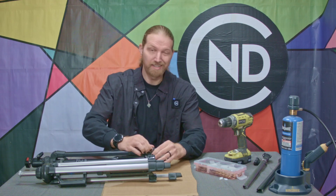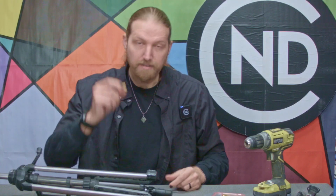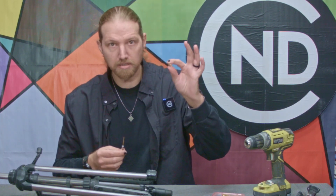That's all cured and feels on there pretty well, so we'll continue on. Now I need to get this threaded insert into here. I'm going to start with a pilot hole and then work my way up to a hole that's slightly smaller than the insert, and then I'm going to try heating it up and melting it into place.